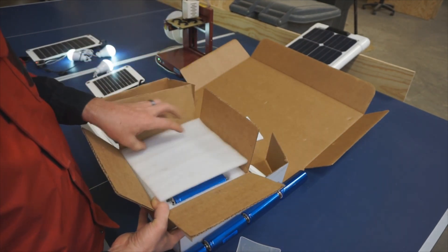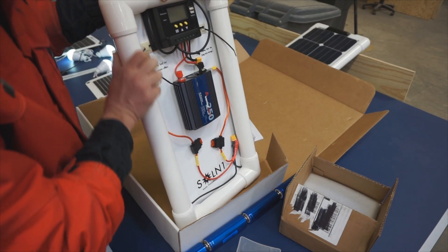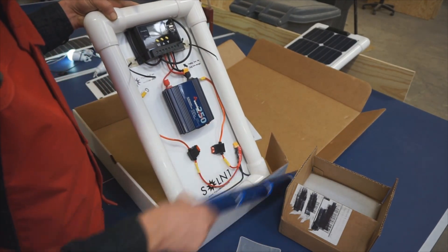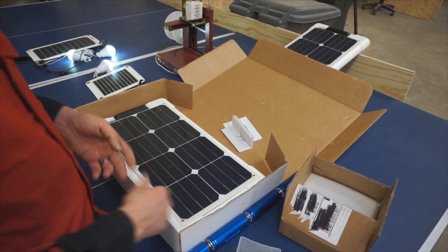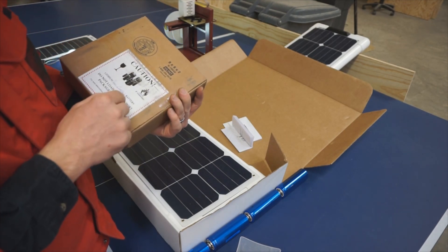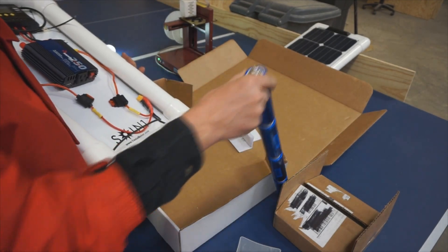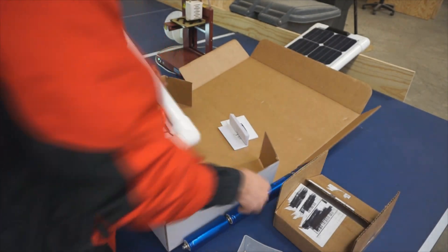You can either order four batteries if you want to build up a 10 amp-hour unit, or eight batteries for the full 20 amp-hour unit. If you order four batteries, you slide a pack down one side of the tube - that gives you half the capacity but a lighter weight unit that charges faster at a cheaper initial price, and you can always upgrade later with a second battery pack. Ordering the kit also gives us the ability to start shipping right away, because there are issues around online training and proper labeling for shipping lithium batteries. This kit option is also great for ordering overseas - you can buy the batteries locally and get a cheaper deal than shipping from the US.